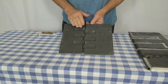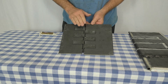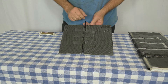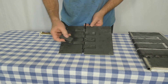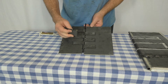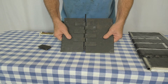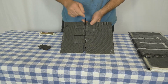Here I'm showing the items that I'm preparing for testing. These parts are going to go to a lab in Texas that's going to do pull testing on them and test them in tensile strength. I've taken the lugs that I created — these carbon fiber lugs that have a brass tube in them for the pin — and I've bonded them to these carbon fiber panels. These panels will be put in a tensile testing machine and pulled apart, and we'll see what comes apart first, whether it's the panels, the lugs, or the pin.